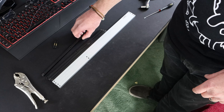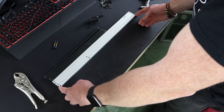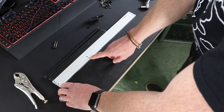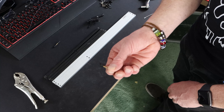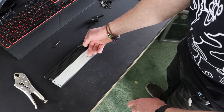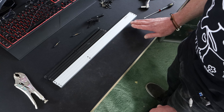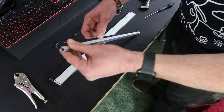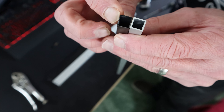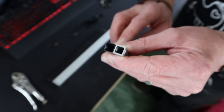I'm going to take these arms down to my garage, get the new aluminium arms cut to the right length, measure them so I can drill the holes for the spring mounts, then come back and put it all together. Here are the original four arms that came off the microphone arm, and here are the four longer ones I've just cut — these are now 50 centimeters end to end. Very important to note: if you're going to do this, you need to measure the distance between the hole at the end and the hole midway down where the spring attaches on the outside. I measured that — it's exactly 16 centimeters on the original — so I've drilled the hole 16 centimeters on the new one too. If you were going to do this permanently you could spray paint it to make it black, but initially I'm not going to bother.